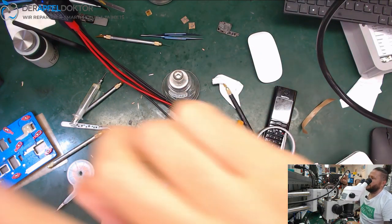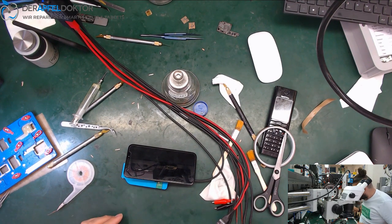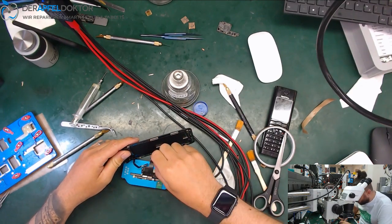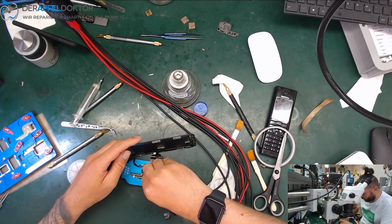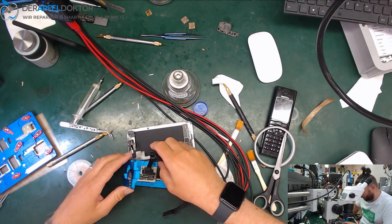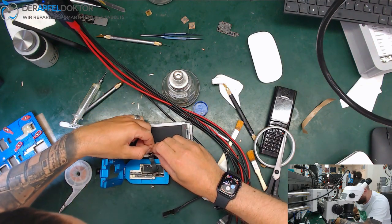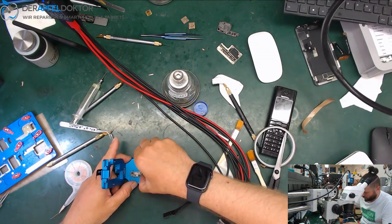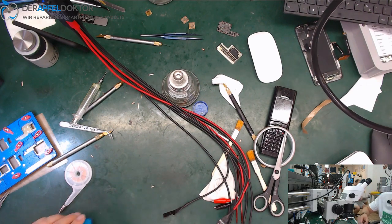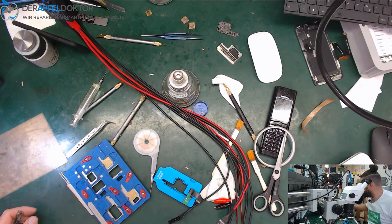We are at 80 milliamps, so we are at the DFU mode. So I will solder the board halves together and show you that it works, that we are at the DFU. Because in this way you can't see anything, and I want you to see that it works. So just move away and do the reball of the board halves.